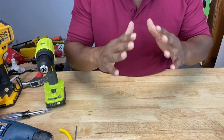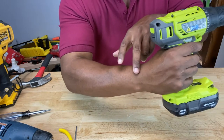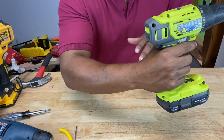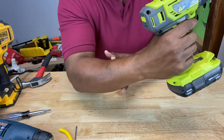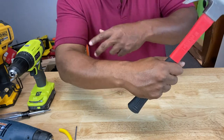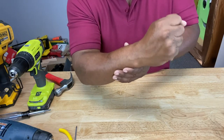The rule is to use tools that keep the wrist straight in the same plane as your forearm. When holding this drill, my wrist is straight — it's not twisting or turning. You don't want what's called wrist flexion, where your wrist has to twist a lot. With a hammer, your wrist doesn't have to twist much either — it's pretty much in the same plane as your forearm. Too much wrist flexion can cause injury, so it's a safety issue when it comes to ergonomics.